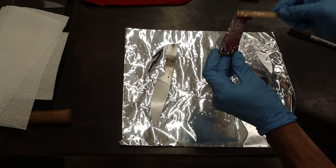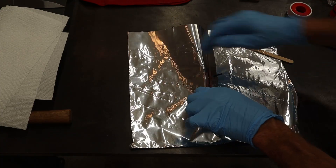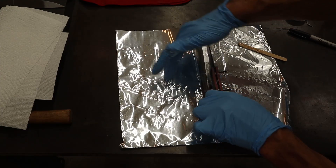Here we go. I like to push the pins through the other side, put a little bit of epoxy on the back side of the pin, and then push them back through just to make sure there's plenty of epoxy around the pin. I'm going to put a little bit on this side and work those pins back and forth — so if there are any little gaps, it pulls that epoxy into the cavity that the pin sits in. I just put a nice amount of epoxy around the pins, knock the pin that direction, then knock the pin back.